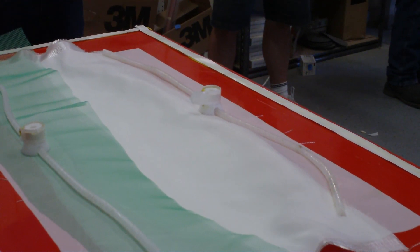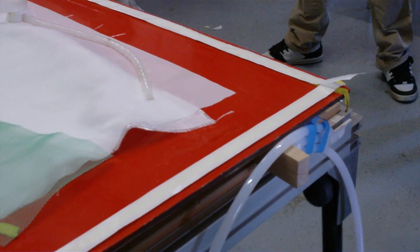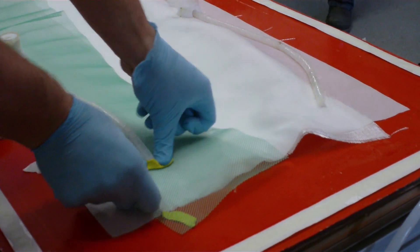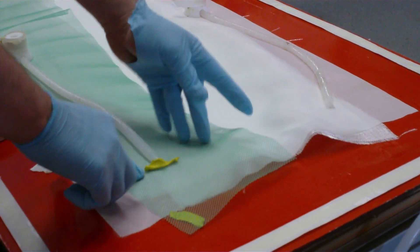As you can see, I've already prepped the edges of the table with the sealant tape. I'm going to put a little bit over the edges of these spiral wraps because the sharp corners are kind of a puncture hazard, and that's the last thing we want.